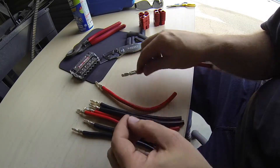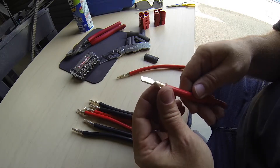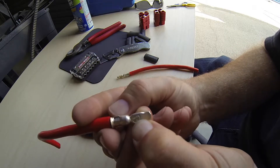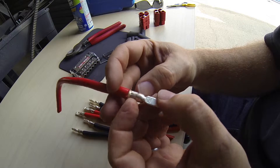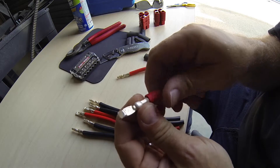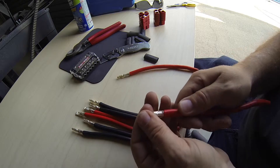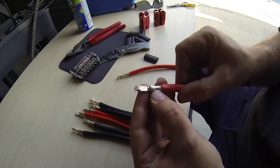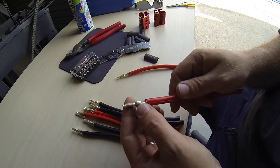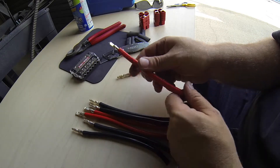So I apparently had some number sixes and number eights mixed up together in the same bin, which is why they came out a little gnarly like this. You can actually see — there's a little number six there for six gauge — which is why this is flaring out like this. It's not supposed to do that. I crimped it on eight and it's a number six. Whoops. They'll still be fine, they just look a little gnarly. This does impact their performance. If you're using something heavy-duty for something this small, I don't think it's going to be a big deal, but it does impact performance on a bigger connector.